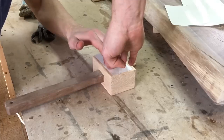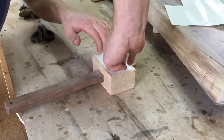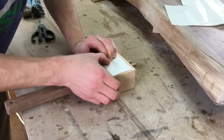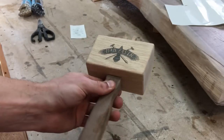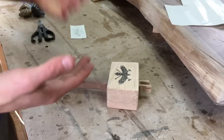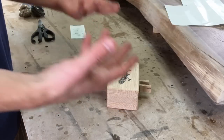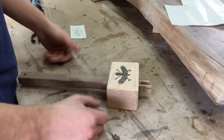With my other hand I'm rubbing that ink into the grain while pressing down extremely hard with this hand. I'm going to switch hands here and rub it in this way. So that looks a little dull right there, but if you take some spray polyacrylic — or polyurethane, that probably works fine too — whatever you do just don't brush a finish on this. Whenever you spray it, that's going to make all the colors pop. If you're doing a color image it's going to look really dull right now, but whenever you spray the poly on, the colors just pop like magic.